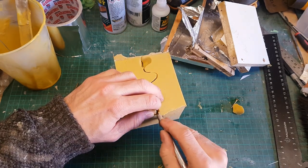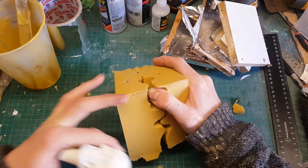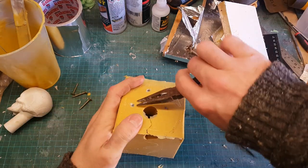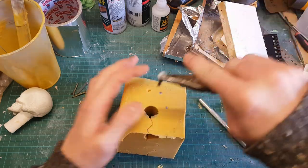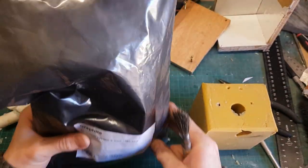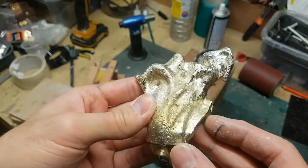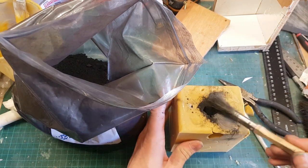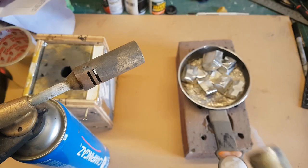After a while it became apparent I'd have to cut much further than originally intended, but I've eventually got the piece out. Unfortunately the cut line goes almost all the way down to the forehead, which isn't ideal but shouldn't be too much of a problem. I'm pulling the air channels out with pliers. I mentioned in a previous video that I've been trying graphite powder - someone suggested brushing the mould with it to avoid pitting on the pewter surface. I'd been using baby powder, but graphite is apparently used quite widely, so I'm going to brush that onto the interior of the mould.